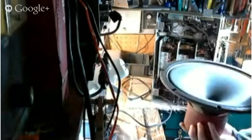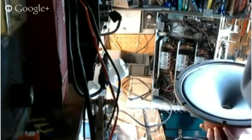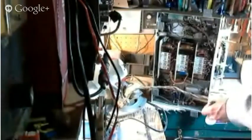There it is. It's a beautiful speaker. It's taken one little hit. It's got some cracks, which I can repair. Those can make a very bad noise. As the speaker tries to push air, the little cracks open up a little bit, and the air will pass through the cracks in the cone and make a sort of sound. Sometimes it's very hard to tell it's the speaker that's doing it, so I'll fix those later. But first, we're gonna plug in the speaker.